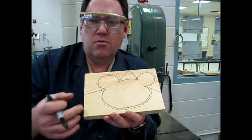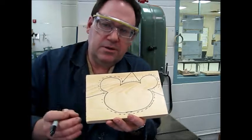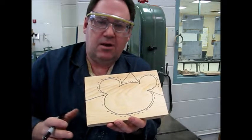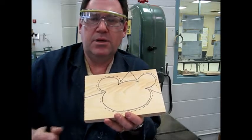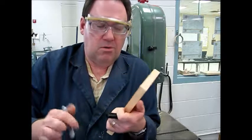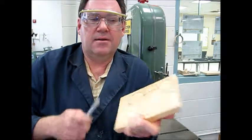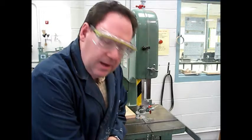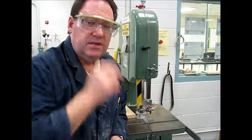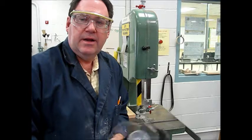These relief lines are going to be the first cuts you make, and then you're going to start removing parts of the wood. Whatever you do, don't try and cut everything all at once — don't try doing it all in one cut. Chunk it; take it in pieces and parts and you'll find it works a whole lot easier and it'll be a little safer too. The on switch for these machines: one is located on the side of the machine, for the other machine it's near the front. So we're going to get ready to cut.